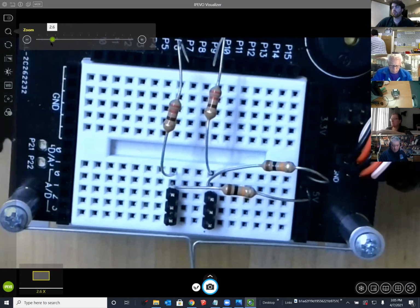And the reason why it's called a breadboard is because when radio came in, people would build their own radios on a board, which was usually the breadboard out of the kitchen. And so the three prongs, as Matt asked, should be in the same row as the resistors, because that is all connected electrically by a little copper strip underneath.